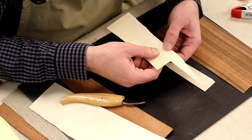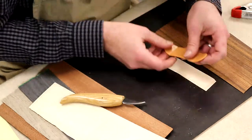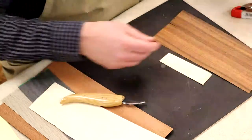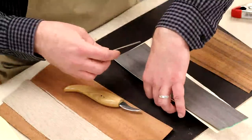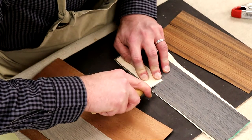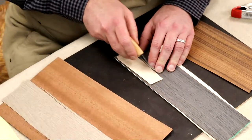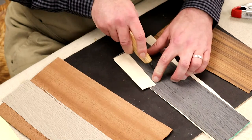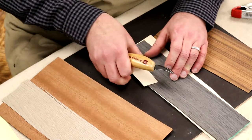This is a really nice one to do with the kids, because everything — apart from the knife — is pretty safe. I cut that one a little bit short, so it's going to have to come from this other piece. Let's cut a couple at a time and use this one as a rough size guide. You could cut this on the scroll saw — just go a bit easy with it, a really slow feed rate, because sometimes the teeth will just pick up on the thinness of material and shatter it. Go nice and easy if you're cutting these on the scroll saw.